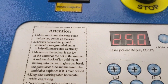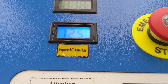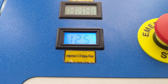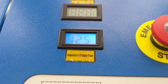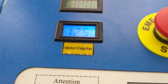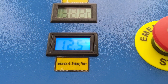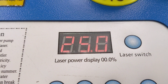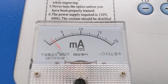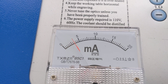Hey there everybody. I recently was having a conversation with somebody about chillers, and during that conversation they mentioned someone trying a very inexpensive and so far seems to be effective way of chilling a laser. So right now we're running at about 12, 12 and a half degrees C, and I've got this at 25% which in raster mode equates to about 3 to 4, sometimes 5 milliamps.